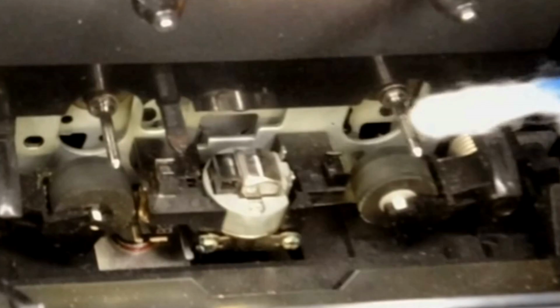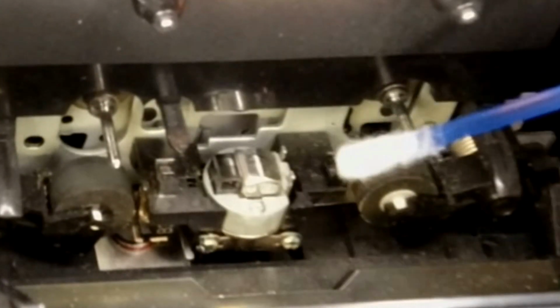As you can see, the erase head is on this thing as well, which means that both heads are rotated when the tape reverses direction. And that's why I said in the previous video that you have to be a bit fussy about these things, because they are not the most easy pieces of equipment to look after.